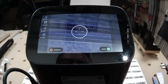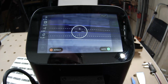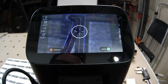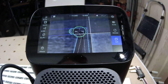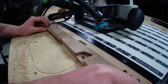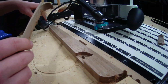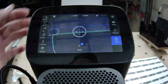While it's autocorrect for your hands, the more error your hands introduce to the system, the more Origin has to work against you or with you to compensate for that. So as you practice working with Origin, you're going to become better at working together with the machine, and you'll get some really incredible results. But definitely we recommend 1/4 inch depth passes for 1/4 inch cutters to start. Good way to build up some confidence there and practice before you go too far into making more aggressive cuts like Jake is on the show here today.